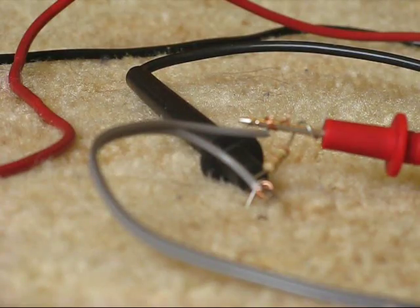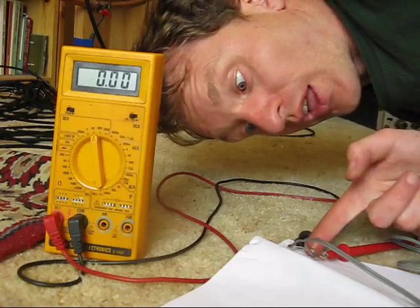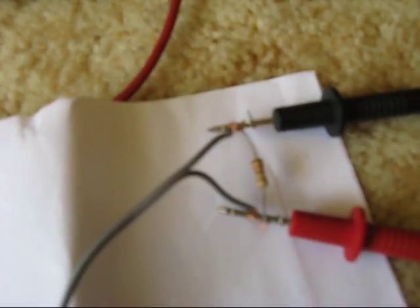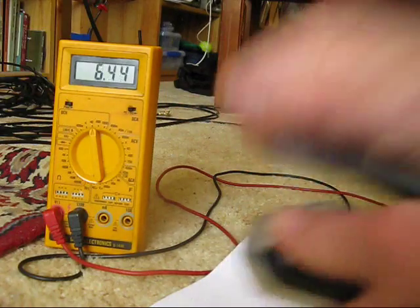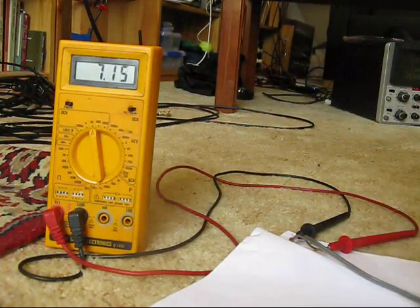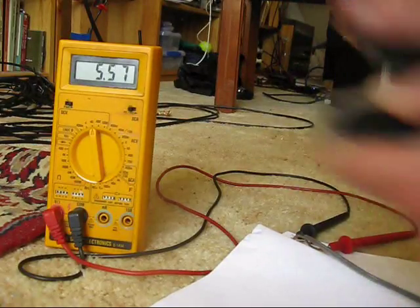Next, the 150 ohm resistor — and it's hot as well. It may be a bit hard to see, but that's a 12 ohm resistor, and the real test of the generator. Cranking it hard — just made six volts. Faster — we can just get it over seven. But we're going to wreck the motor. There's a smell in the air. The resistor is cooked.